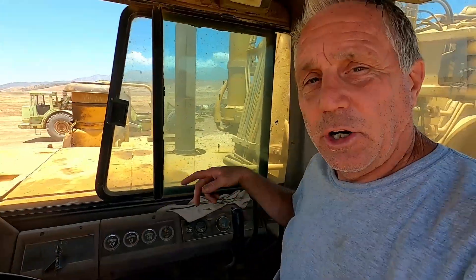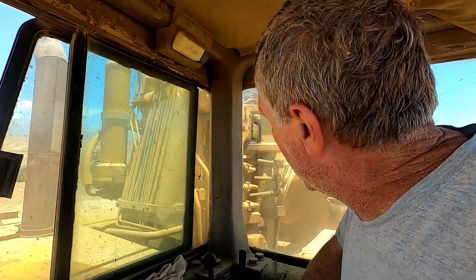All right, well, that's it. A couple of people commented they wanted to see this thing run after the last video where we took it all apart and troubleshot the issues. That's it — 600 horsepower and 2,018 foot-pounds of torque is what this is set at. This machine weighs about 100,000 pounds — I guess that's with the twin engine. They hold 104,000 pounds of material, depending on density, moisture, and what they're hauling — about 35 cubic yards. These 657s will move more dirt faster than anything you'll ever find. They are just an incredible scraper. Tons and tons of material. Thank you guys for watching — please hit that like button, share the video, and subscribe if you haven't already. Have a good day.